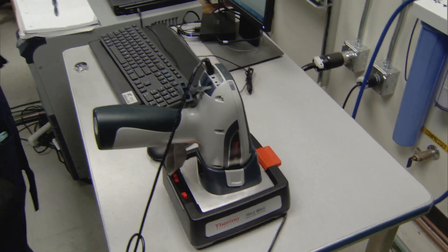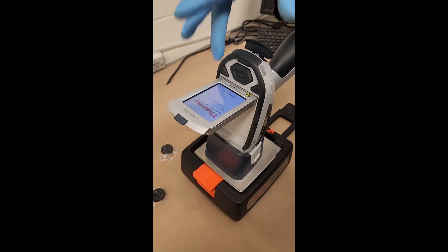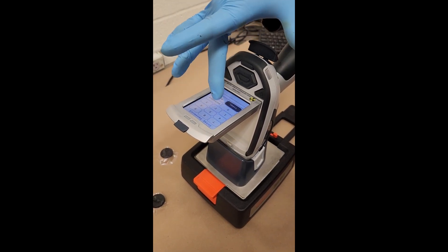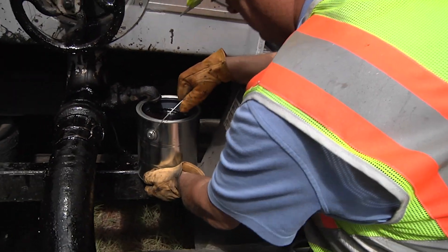So the intent is to give the district the tool to be able to run the test as soon as possible. These X-ray fluorescence guns are portable, so you can either have them in the district lab, or you can take one out on the job site on the side of the road and get a sample from the distributor or the tanker truck. In a couple of minutes you can run the gun and get the answer — right on the side of the road before anybody actually even sprayed any of the asphalt on the ground — to ensure that you had the right tire rubber content.